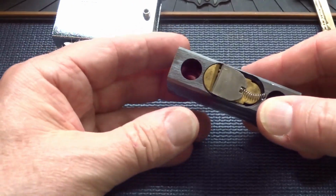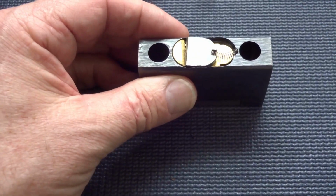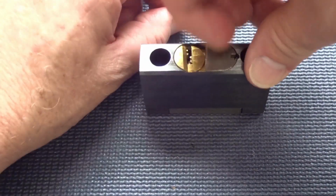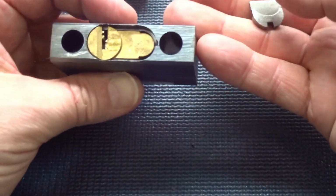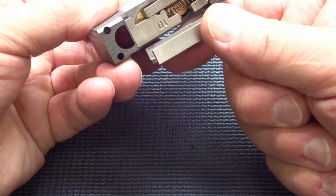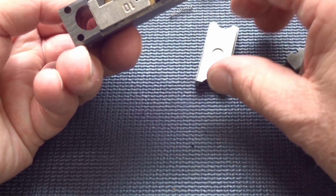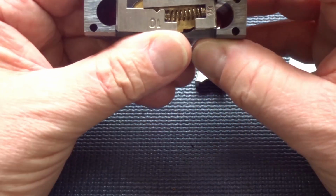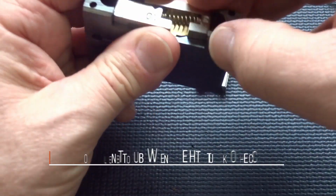All right, I set him off to the side. There's our shutter lock. And there goes the shutter lock spring. All right, stay with me here. I have never seen the innards before. Okay, there's the locking mechanism itself, the 2 locking pawls, and they do appear spring-loaded.